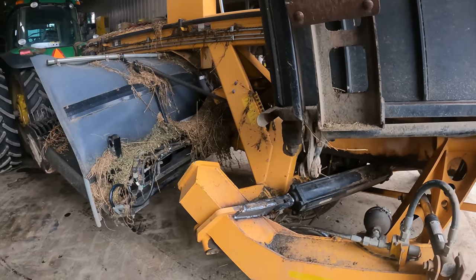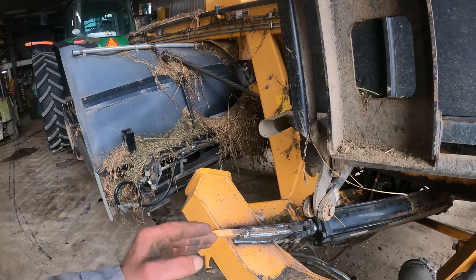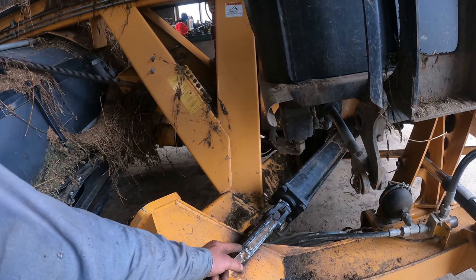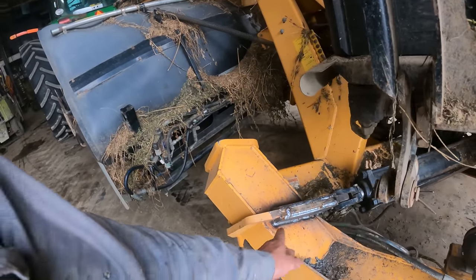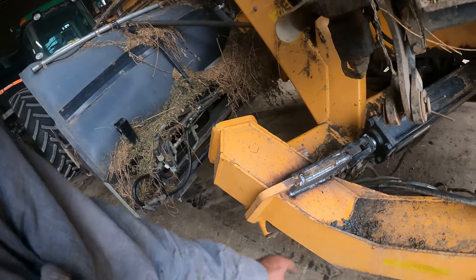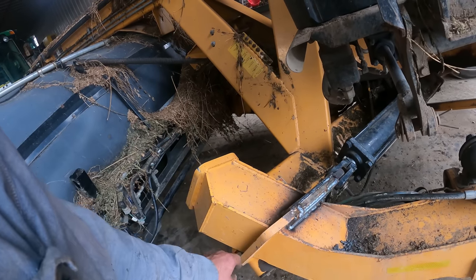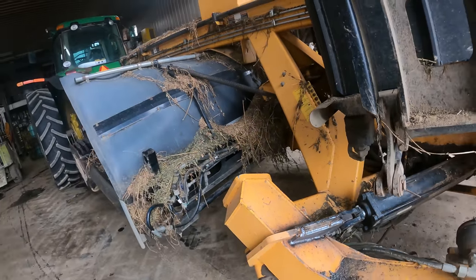Well, I guess we've got this job done officially. That tab, the way we had it welded on there, probably would have been fine, but I feel a lot better now that we've got a couple of plates put alongside of it. So I used some 3/8 by 4 flat bar, shaped it out to the shape we needed. This is where it's butt welded to it, and then this was welded to this piece here. But this here might only be 1/4 inch. This is 3/8 here, but we don't know what they capped this with. So as far as that lug goes, it's nice that it's all kind of tied back together here.